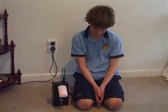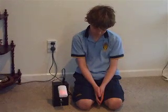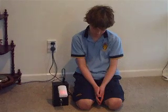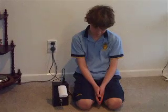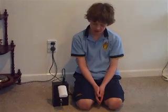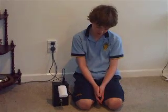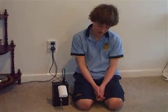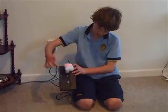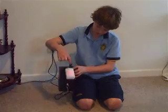Step 2. Pass in front of the PIR and the light should turn on. The LED underneath the PIR should flash and the alarm should sound. As you can see here: LED, alarm and light.